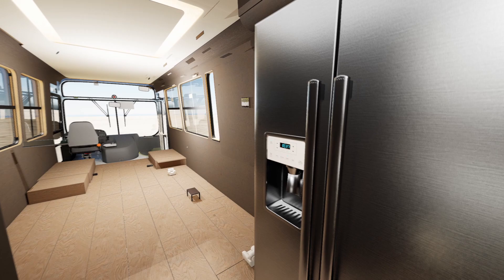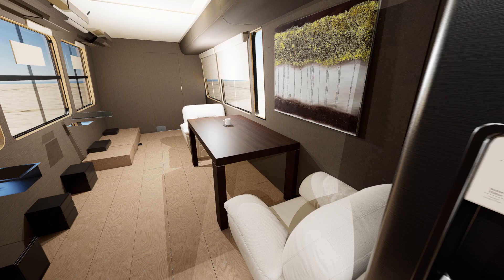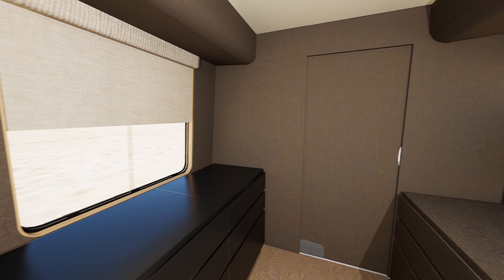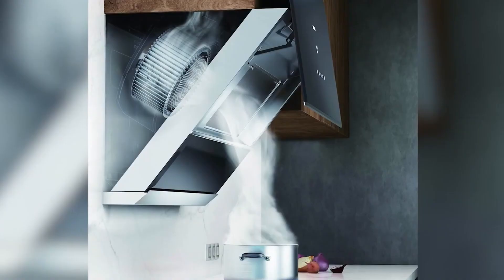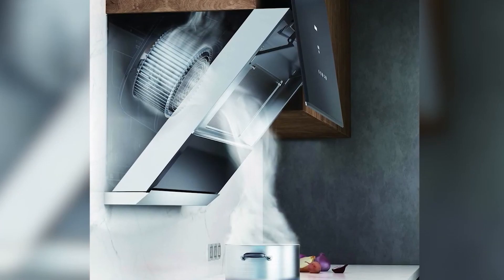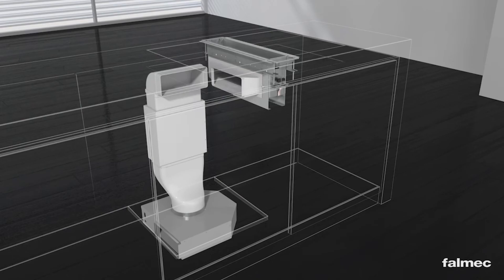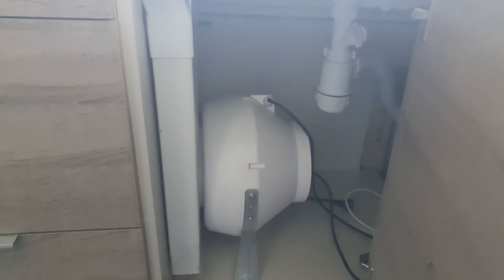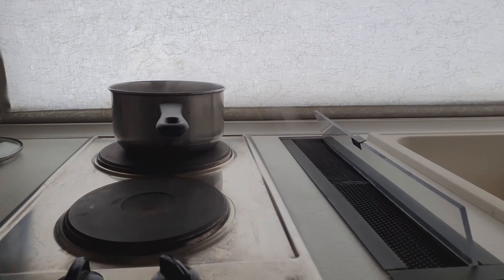In the main room there is a kitchen, as well as overhead cabinets assembled on the same principle as regular cabinets. Roller blinds are installed on the windows, with manual opening and closing to save on the budget. Chairs need to be purchased as making them yourself is not simple. The only non-standard solution in this house is the kitchen hood — a standard hood won't fit the interior design and removes at least 200 cubic meters of air per hour, causing heat loss. Built-in hoods with odor filters exist but start at $2,000. I made a similar hood for my house for $65.